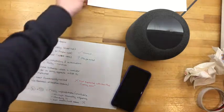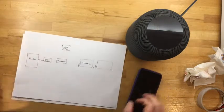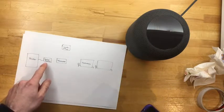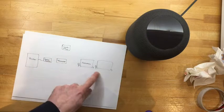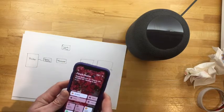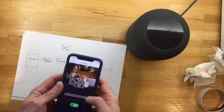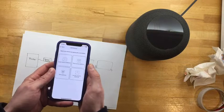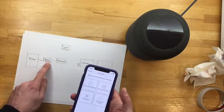Now, I think I've sorted that out because I rang the support shortly afterwards and they explained that I didn't quite have it set up right. So what I thought I was doing was I needed to just link all the devices, the boiler switch, the thermostat, and the radiator valves with the Link Plus. So actually, I went in and added the device, and I went into the heating and actually added the boiler switch as a device. And I've learned that actually that's the wrong thing to do.